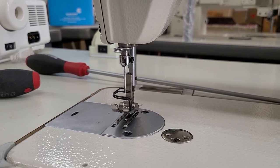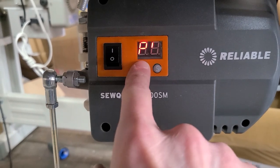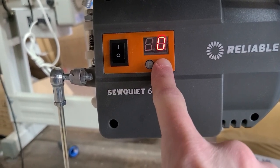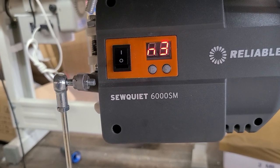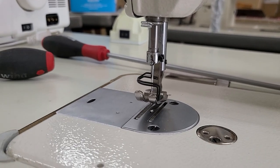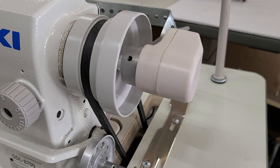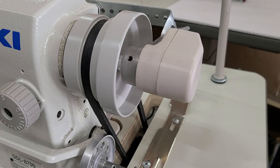It's not going to always be perfect like that — you may have to make some adjustments to the synchronizer. So right now I'm going to show you this part. Hit the P button until you see N2, so it's three times. And now hit the S button — zero right now is needle up, one should be partially needle down, but we may have to make some adjustments. Hit that P button again to lock it in place and now you'll see N3. We're not quite needle down, so this is where we're going to have to make an adjustment. So the reason I tightened only one screw originally on the synchronizer is to make this a little easier — to put it in needle down or needle up. Right now my motor is set to in between needle up and needle down, so I want to make this adjustment.